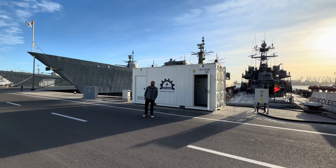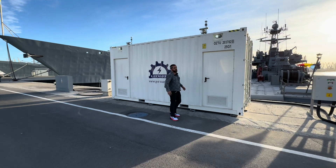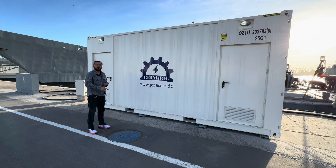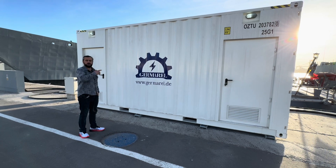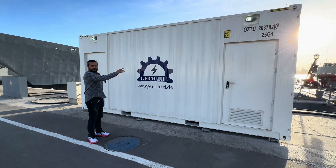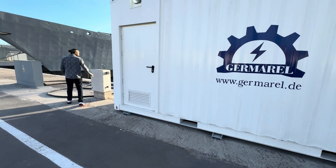Now as a general guide, I will show you and inform you how to choose a frequency converter. The frequency converters — like this one — come in a 20 feet high cube container. We also have 40 feet high cube containers, 20 feet normal container, or 10 feet container. This is a 20 feet high cube container because it has one piece of 1,000 kVA, 720 kilowatt, with an electrical distribution board inside.